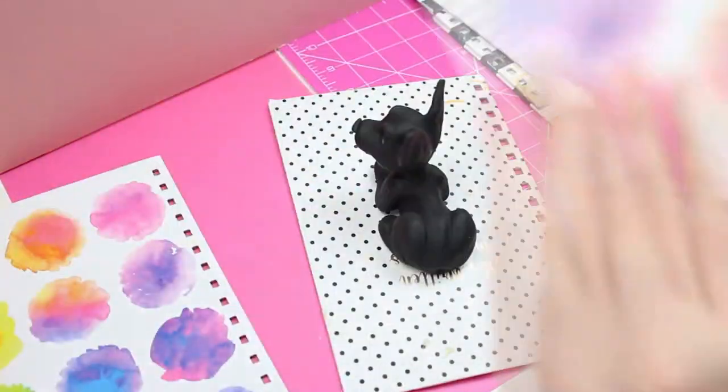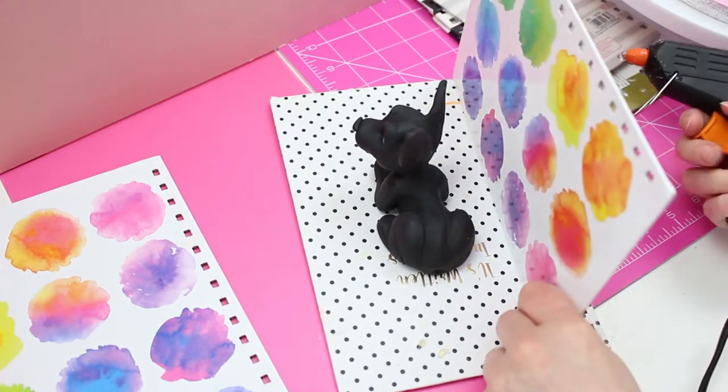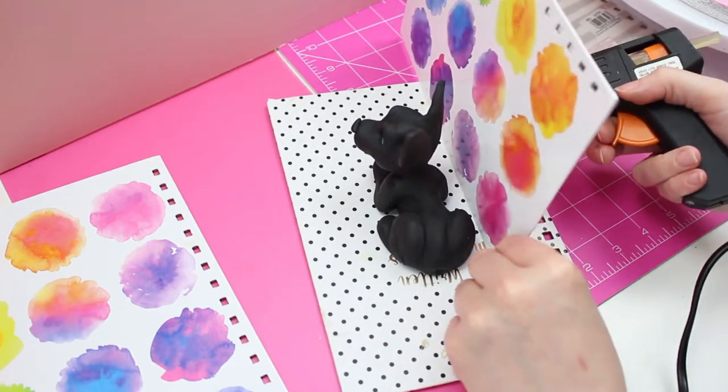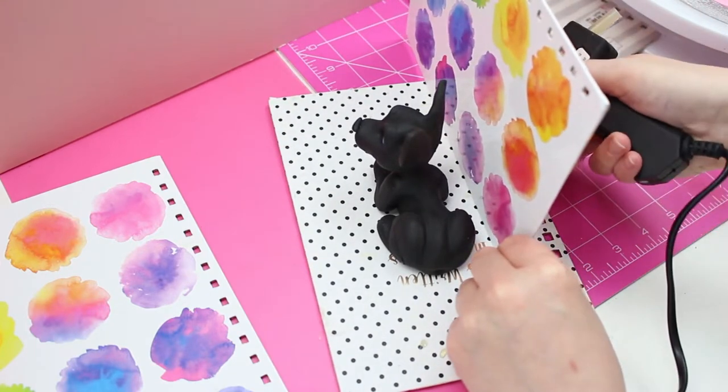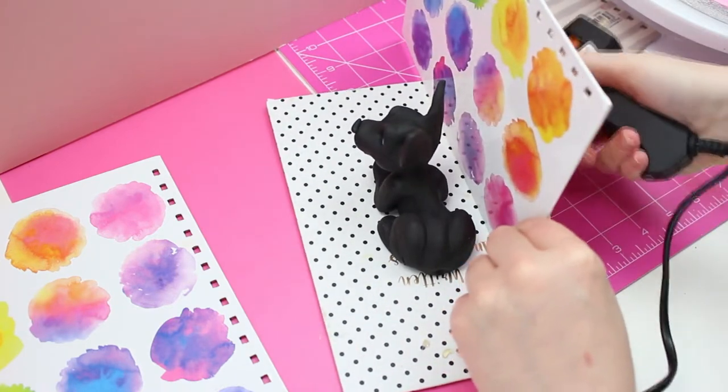I'd recommend when making the mould box to leave probably a 1 centimetre or more of space between the sculpture and the walls of the box. Found if there isn't enough room, sometimes the mould can be quite soft and it can distort your sculpture when you're moulding it. To keep the walls all nice and together, I just used the glue gun again.